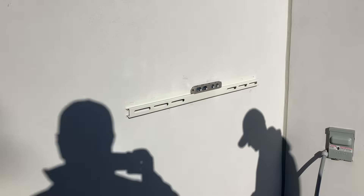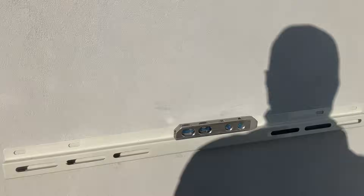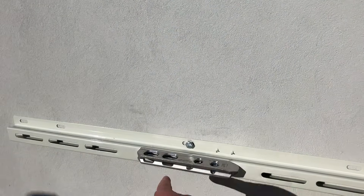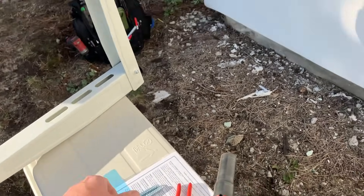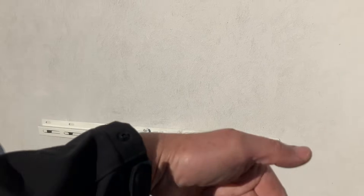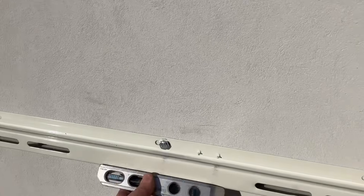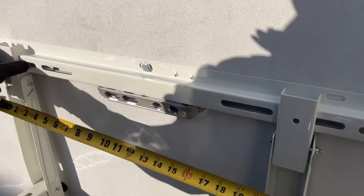One of the first things we're doing is installing the wall-mounted bracket. You could also start inside working on the indoor unit first, but we're starting on the outdoor unit. I got one lag bolt through my stucco going through the foam and into plywood. We have two different sizes here because of the stucco — the four-and-a-half and the five-and-a-half inch long lag bolts. We'll check inside to make sure we're not penetrating too far or hitting anything we shouldn't. The staircase is on the other side, so we should be within the wall cavity with no problems. Center of our feet is just over 22 inches.